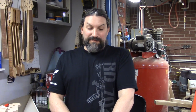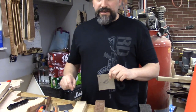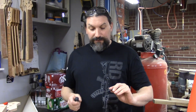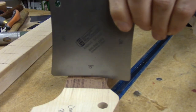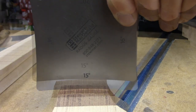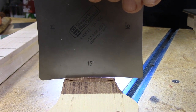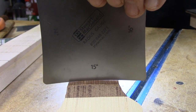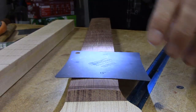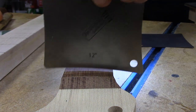So that is the whole compound radius in a nutshell. Chris has reminded me that we want to take the 15-inch radius gauge that works right down at the body end and move it to the nut, which as you might remember was 10-inch. As you can see there's some light shining in on the edges where there are usually no strings — so that kind of gives you an idea. Now putting the 12 on there — that's about seven-and-a-quarter.